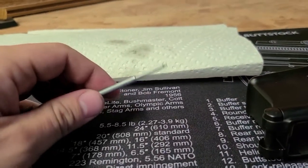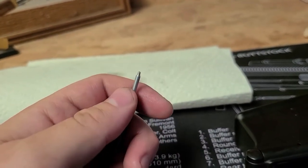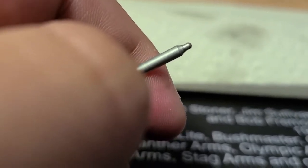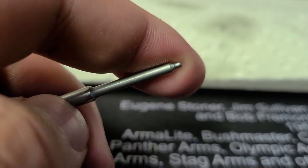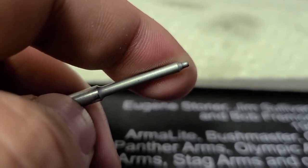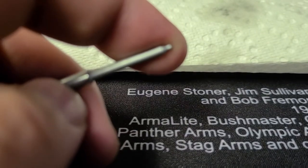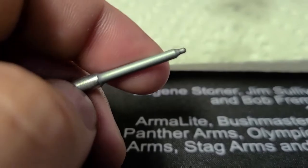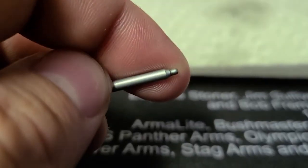Here's your firing pin — this is the enhanced version for the 7.62x39. This nipple here on the end: I no longer have a normal AR-15 firing pin to compare it to, but if I did you would see that this is a bit longer, so it can properly function with the primer of a 7.62x39, and even more so to efficiently set off the primer for steel-cased ammunition. I'll put links to these parts in the description.